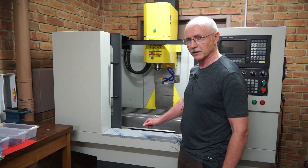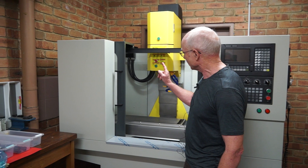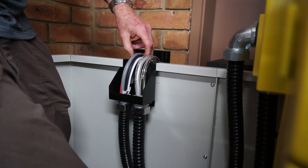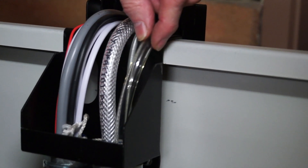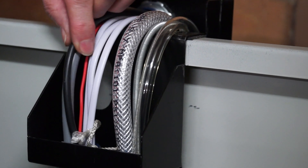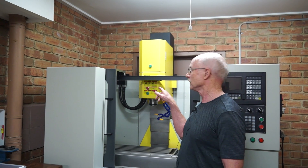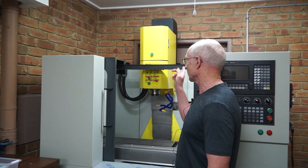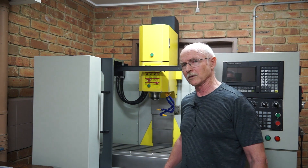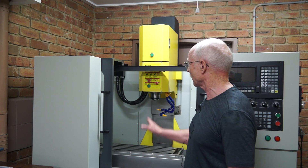One of the tricky points — which I'm sure Aaron will show you later — is over the back here, the connections and services coming up for the Z-axis: compressed air, lube, coolant, and electrical for the spindle drive. There's a lot of things happening there. Because I've got this very tight corner, normally you could just accommodate some penetrations in the back wall and take the services out through the back wall into your control box and down to the lube pumps. But in my case, because the corner's so tight, I've elected to make a little box which just sits on top of the rear panel there, so I don't have a penetration.